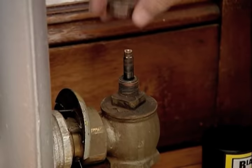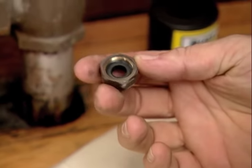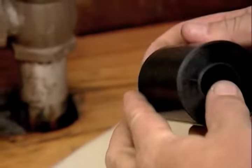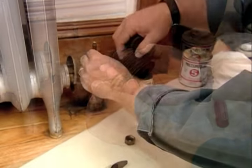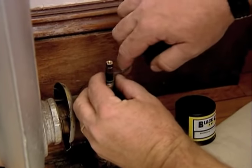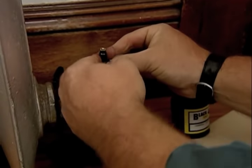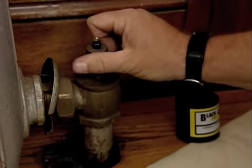That's a little bit hot. Now, there's supposed to be a complete gasket in there, but it's all worn down over time — see the black that's in there? We could try to find the exact gasket, but they also make graphite packing like this. What I really want to do is just make my own new gasket. I wrap that around a few times, and if I put enough wraps on there and tighten that nut down, it will compress. Let me get that cut, then we put the nut back on and tighten it up.